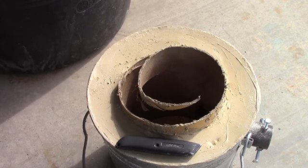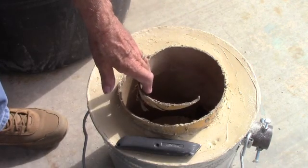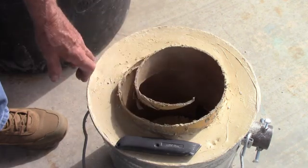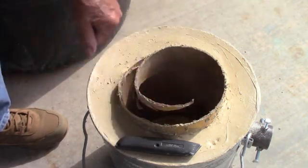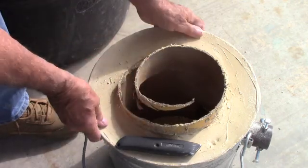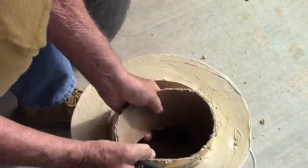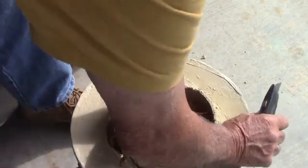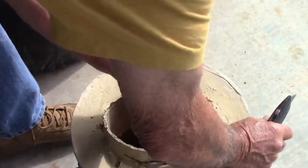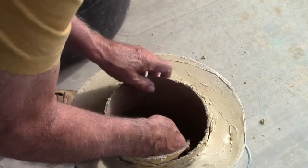Okay guys, typically a sonotube is used to make a base for a post or for a light pole or a flagpole or something like that, and the concrete is actually poured inside here. So what you do when you go to strip the sonotube off is you cut the corner like I did here, and you just unpeel it around the outside of it. Well, this we did just the opposite, so this is on the inside, so I'm having to cut it as I go in order to get it to tear. And now this is going to look really ragged on the inside here, but you know, that's what you got to do. So I think the best procedure here is going to be to cut it loose right here.